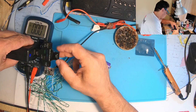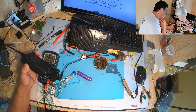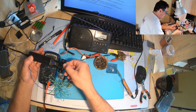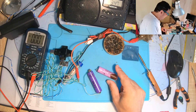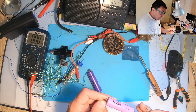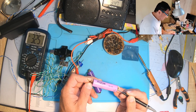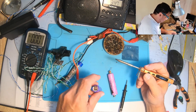We have power to the radio - nice. Now let's check the charging current. We have a red LED showing charge, but there's no charging current - just a very shy 3 milliamps at the beginning. Maybe the battery is fully loaded. This is an old cell ready to be disposed, so I'm discharging it to maximum to avoid problems. At 3.25 volts, now we should have a charge for sure.